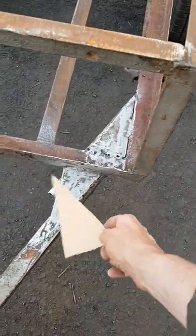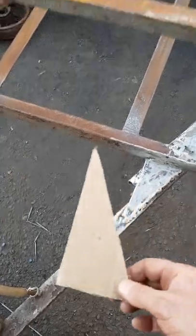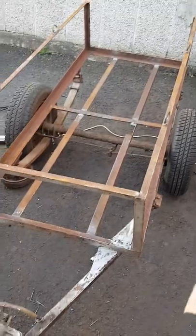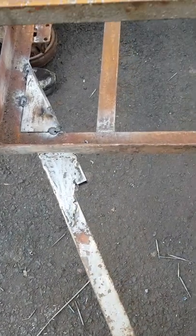We've been doing a bit of welding and grinding here just to strengthen it — we've actually put some gusset plates in. What I did was get a piece of cardboard, cut it to shape so it would fit, then scribed round a piece of metal, cut the metal with a cutting disc, and just tacked and welded them on. We've got a lot more welding to do — we've got to finish it off really — but just to show you a little bit what's happening. We've got more welding to do and then rub it off.